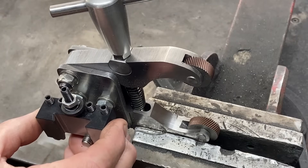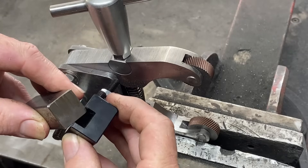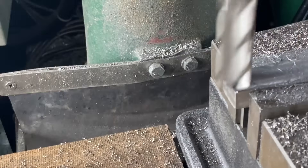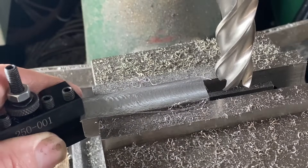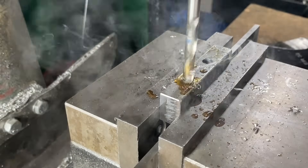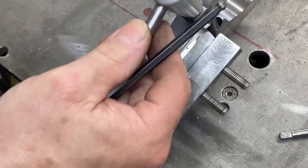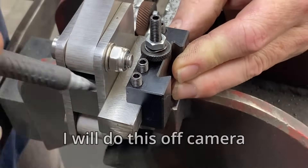This tool holder needs to be mounted on the side and I need to use a bit of steel here, so I'm using some 20 by 20. I'll drill some holes through that and mill it down to fit into the tool holder. I start by squaring up the block, then take the last surface down to 13 millimeters to fit into the tool holder. Now I've got to drill some holes and tap them all the way through as well. Then that block is bolted on the side, I chop those bolts off, and I also need to chop off the extra at the end.